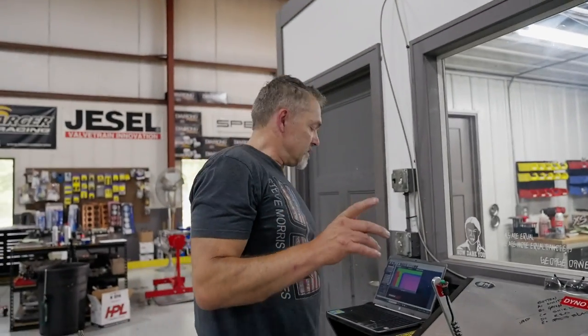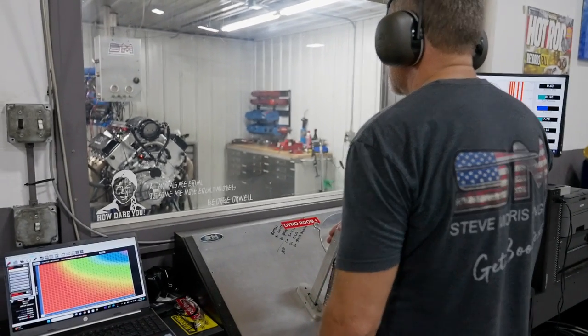Okay, so that's just the first hit, so we don't have a tune done for this yet, so I didn't even bother recording data on the dyno. Didn't really care, because all I really want to see is what a tune-up looks like, so I can build that base map and base timing.